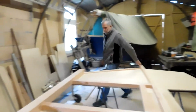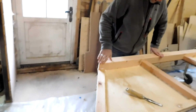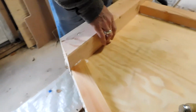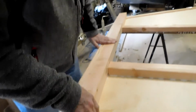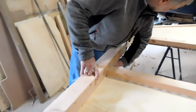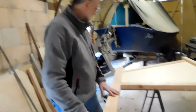So, first of all, the floor beam, which I showed you before, had that sort of double rebate on it. One piece sits down onto the ply panel. In the middle here, it sits tight to the batten that's on the other side and leaves a rebate. You're underneath, Hazel, it leaves a rebate here that the engine hatch sits against. Come back up the top.